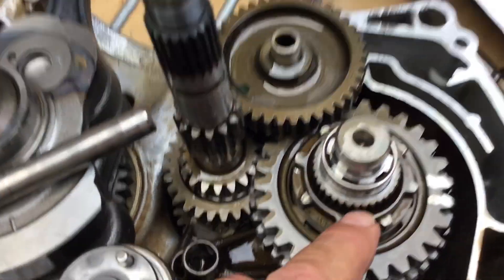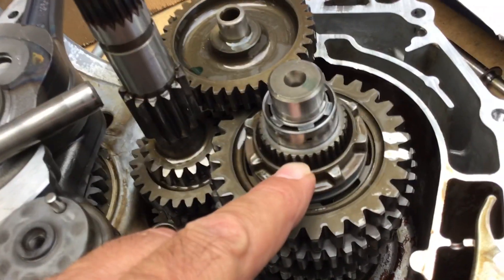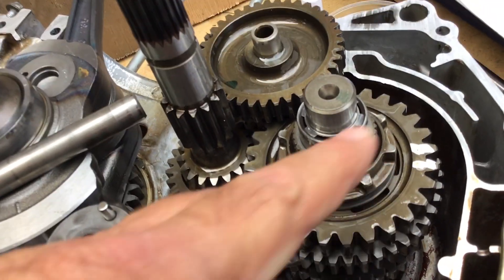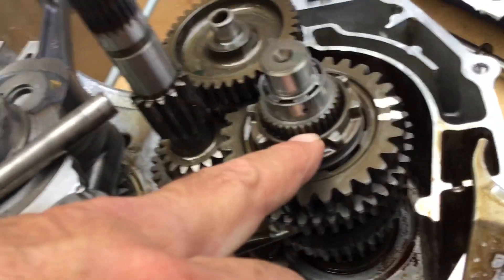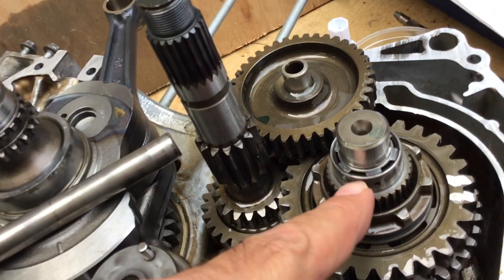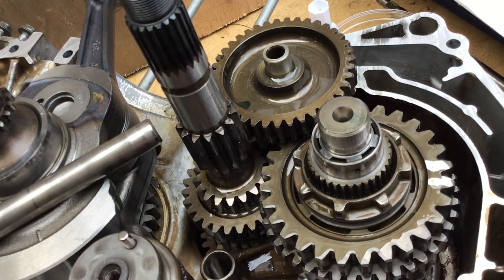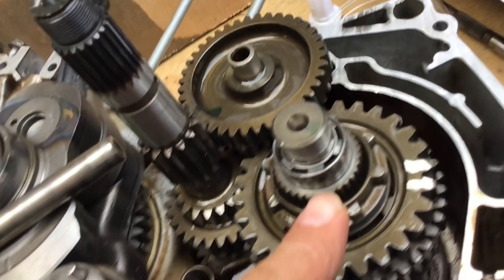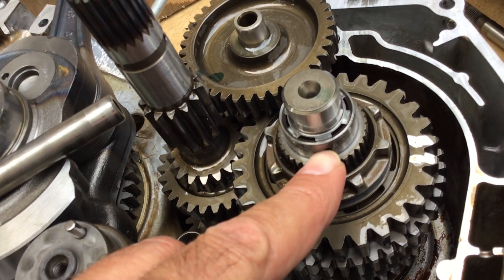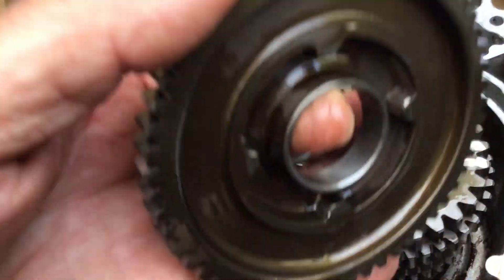And the same also applies to this spline sleeve — these sleeves slip on and they are different lengths, so you can't really get it on wrong, but it would be a nuisance if you got this far and then realised your crankcase won't go together. Also, this is a bush that engages with the spline, and there is a plain bush inside of this gear. Everything is so beautifully made. You'll see there is a drilling there — do make sure that you have your drilling lined up so that you get a true oil feed all the way through the bush into the running surface.